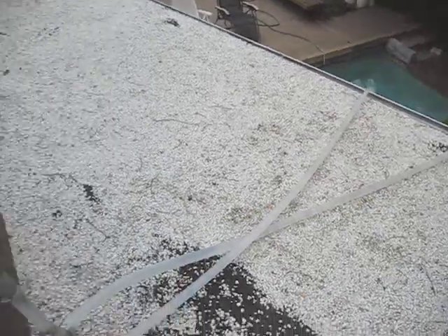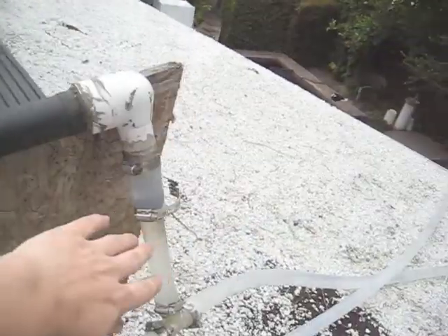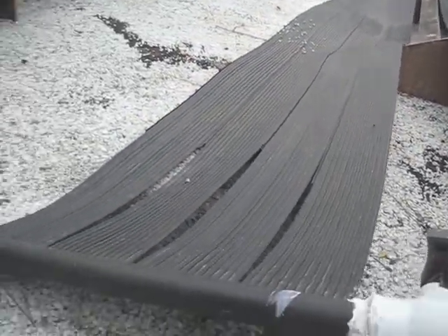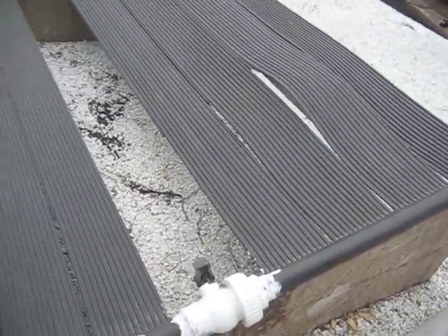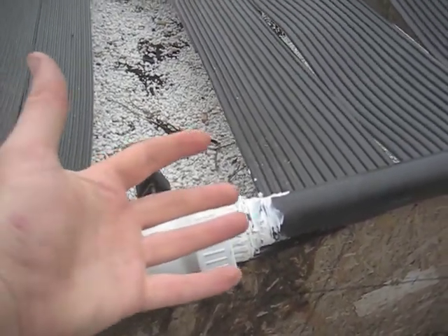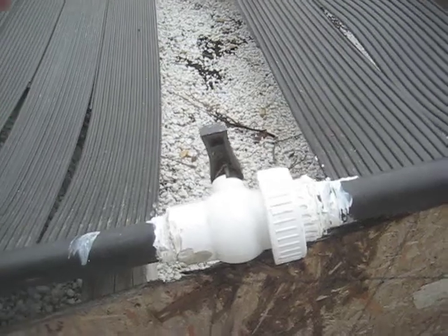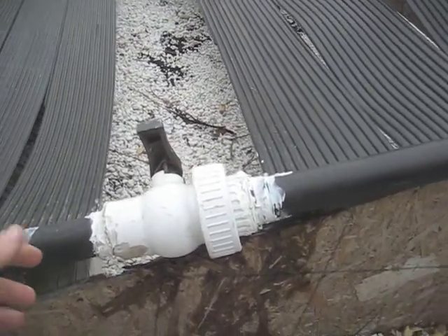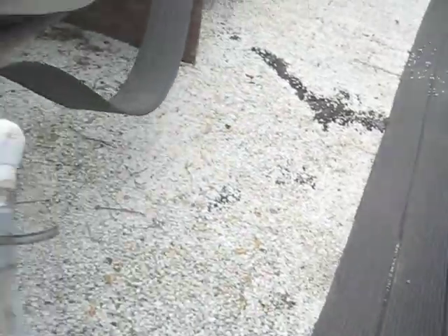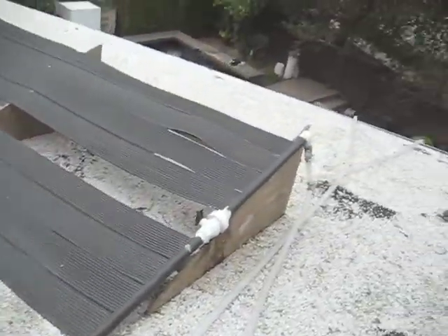On top of the roof is where we actually have our solar water heaters. These were available from a pool supply store, and the cold water from the pool comes in and goes across these black tubes and it comes back, then it joins up the other side. But there are small leaks in this thing on some of these joints. What we found is it doesn't really matter because the only thing it does is suck in air instead of leaking water. Because at this height — we're 14 feet off the pool — there's actually a lot of vacuum being created by that, so the water is actually sucking the air in. You can hear it a little bit over here, but it's not something to be too concerned about. It still works just fine, it just carries a little more air with it.